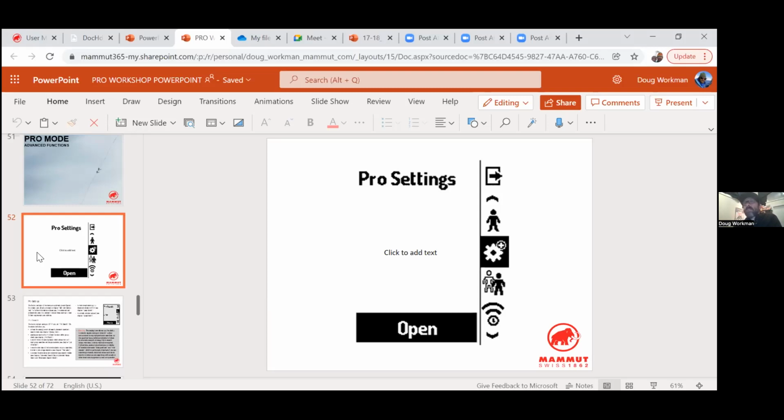So when you're using digital and analog at the same time in these pro settings, you now have a clue for when you might actually benefit from going to an alternative search strategy like a micro search strip. So again, the pro setting has a lot of capabilities. Once you go into pro mode, if you decide you want to customize it further, say you don't want to use that smart search function, which is that fine search GPS style searching below 3 meters, and just get a classic cross and do your own grid search, you could change it to that.